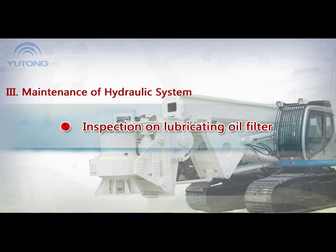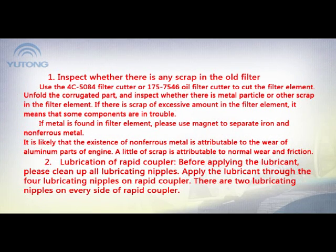Inspection on lubricating oil filter. 1. Inspect whether there is any scrap in the old filter. Use the 4C5084 filter cutter or 175-7546 oil filter cutter to cut the filter element. Unfold the corrugated part and inspect whether there is metal particle or other scrap in the filter element.